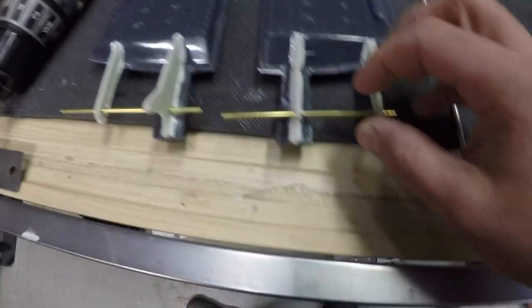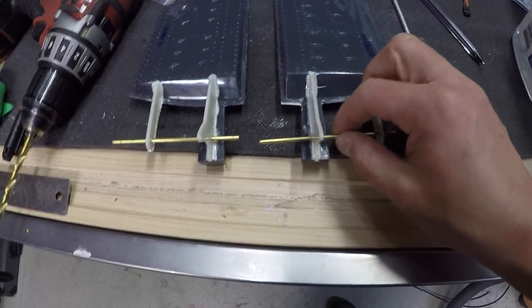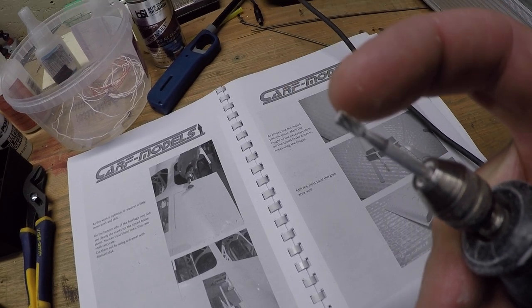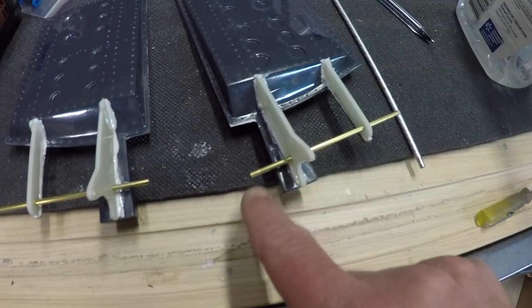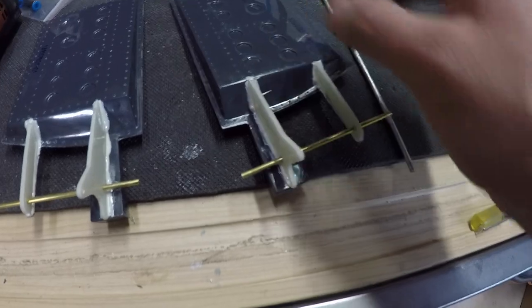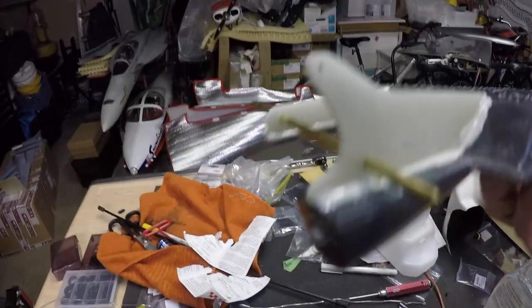Alright guys, working on the air brake next. I glued these up last night and everything went together really well. It's fairly straightforward — I just took my Dremel with a fairly narrow carbide bit, which allowed enough width for the fiberglass piece to slide in. I used it to roughen up the flat section, and there are pieces in the moldings to make the vertical. Everything fits together really nicely.